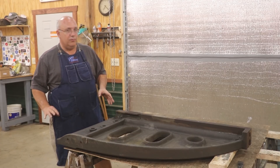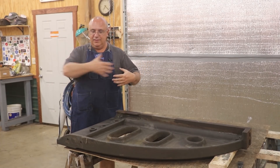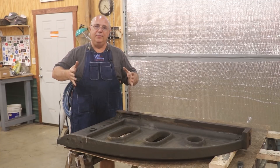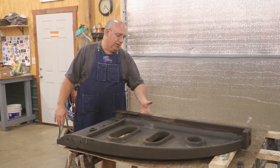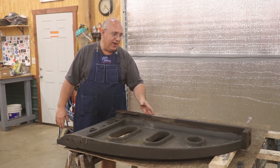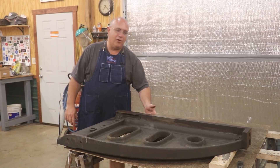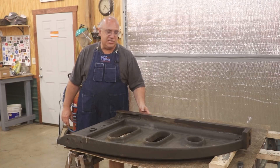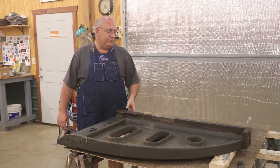The next big thing I need to work on are these uprights or stanchions - the two pieces that come up on the side that the cross member rides on, that the clapper box is on. So this is the adjustment for going up and down on that planer. On the front of this is a precision surface. I have not checked this for accuracy to see how bad it's out. My game plan is that I want to scrape this back in and get it trued up, hopefully without any machining, grinding, or milling.